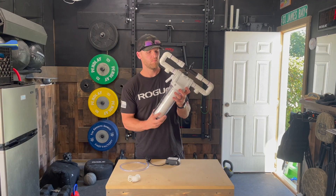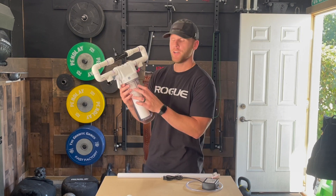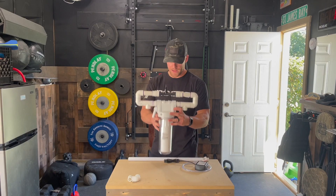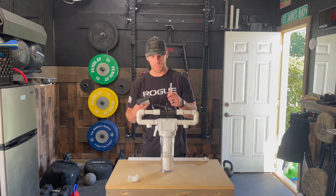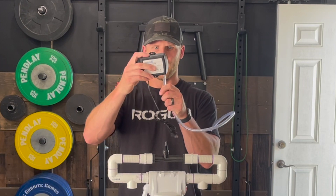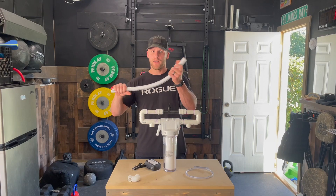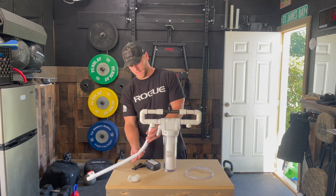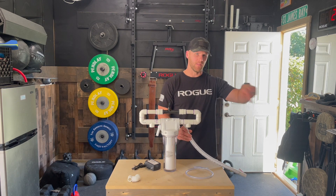After holding for 30 seconds, you can twist the bottom of the filter back on. You now have your very own DIY state-of-the-art water filtration and sanitation system for your DIY cold plunge. What's left is to attach your ozone generator to the unit — basically just putting the hose on there and attaching it. Then hook it up to your actual cold plunge. I'm using flexible PVC tubing, cementing and gluing it in on the inlet side. It'll go through sanitation, and the same type of hosing on the other side will filter back into the tub.